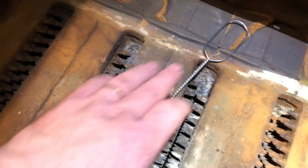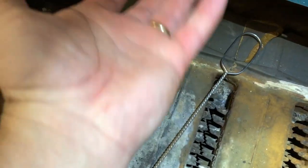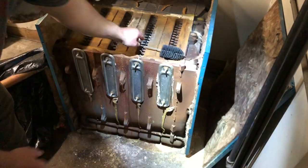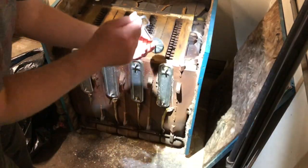When you clean these things you can always get little bumps and bruises, so just want to be careful. I'm going to go ahead and remove these cleanout covers, replace the gaskets, and then run this boiler brush through horizontally to get anything I couldn't get when I went through the top.